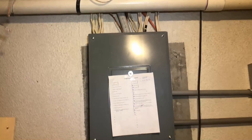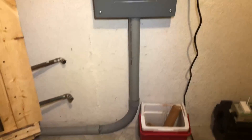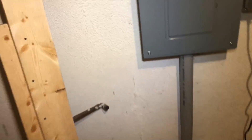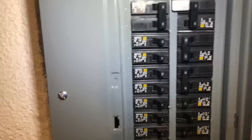When we moved in we basically got everything replaced and also added a new daughter panel. You can see this big conduit — it basically goes down this back wall way back there where the air conditioner is. It's fed by this circuit breaker right here — it's a 90 amp circuit breaker and it's up to code with the correct size wiring and everything.